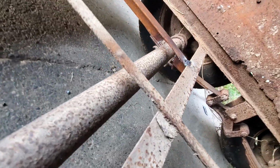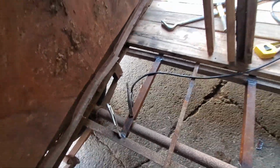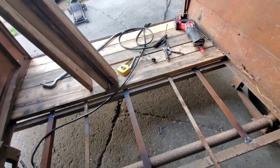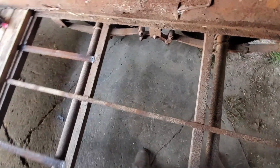Alright, that is exactly what I did. This one was in place, so I notched that one out. These other two I notched beforehand and then welded them in. So now we've got that in place. This next one I'll have to measure more precisely since we don't have any overlap. Fit right in between those three, and then notch these three again, and that'll be an easy one, overlap both ways. And then a few in the front there to finish her up.